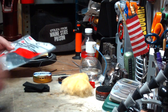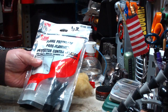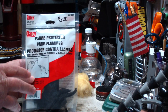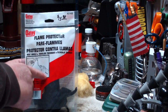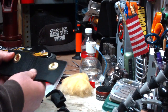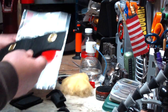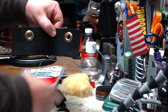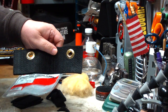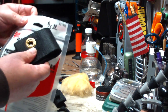I started with carbon felt — this stuff you can find at any Home Depot. It's a flame protector for when you're soldering pipes up in the rafters in your basement. You may be soldering with a propane torch but you don't want to set the wood on fire. These were sheets — about 9 inches by 12 inches, or 23 by 30 centimeters — a little rectangular-shaped panel that you could nail on the wall behind whatever you're soldering to protect the wood.